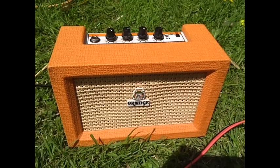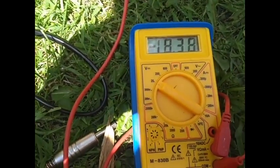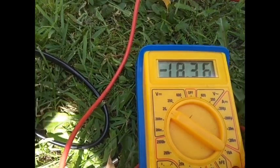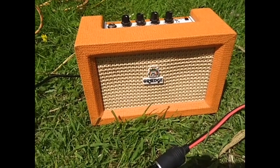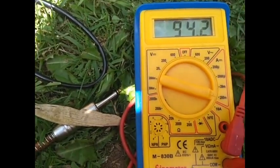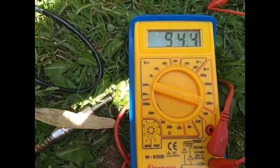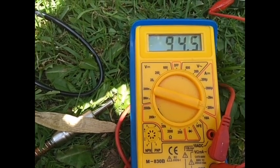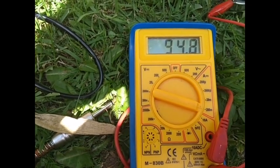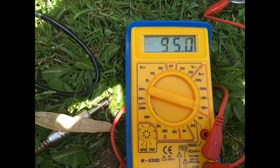I've just turned the amp on now and I can confirm the voltage has dropped to minus 18.3 volts. So yes, it is drawing a bit of current. The current drawn by this amplifier switched on but with no guitar playing is 94 milliamps — about 100 milliamps just doing nothing. As I plug the guitar in the current will get higher. On this particular day it's quite sunny, although the sun does go in and out a little bit, which limits the maximum volume of the amplifier, but the current will rise as you see me playing the guitar.